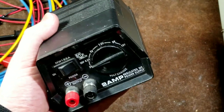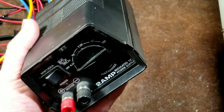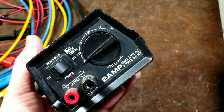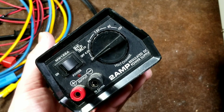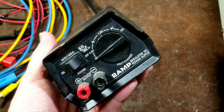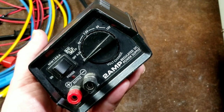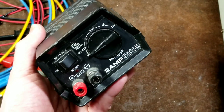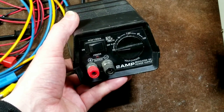Electronics that run on batteries — batteries themselves put out virtually zero noise. They're almost perfect in that respect. So when you're using a testing device, especially for lower voltage battery-operated items, it's a big deal that they have very quiet, well-regulated power. A switching power supply could have hundreds of millivolts of noise, where something like this might have 0.3 to 0.5 millivolts — so the difference between 0.003 to 0.005 versus hundreds. Big difference. That way you won't have any unexpected behavior from digital electronics that use replaceable batteries.